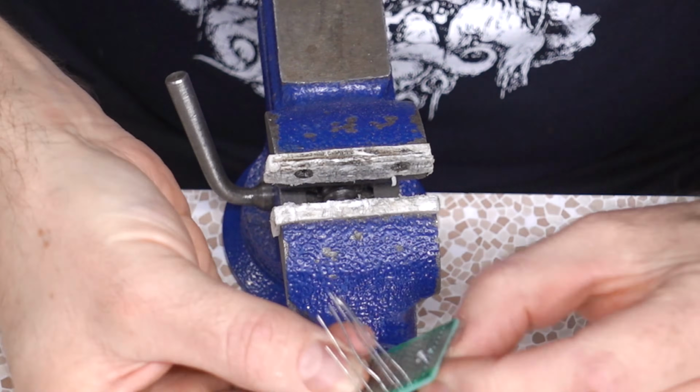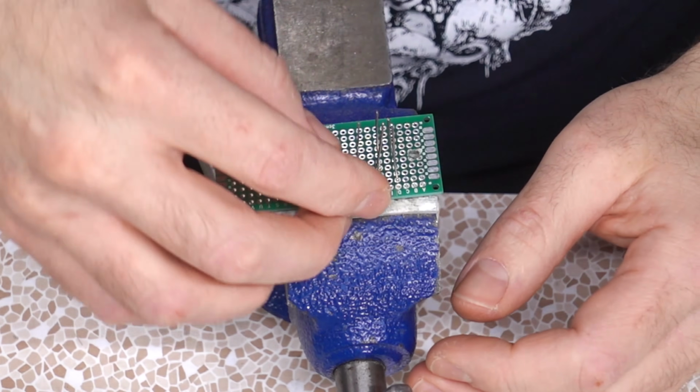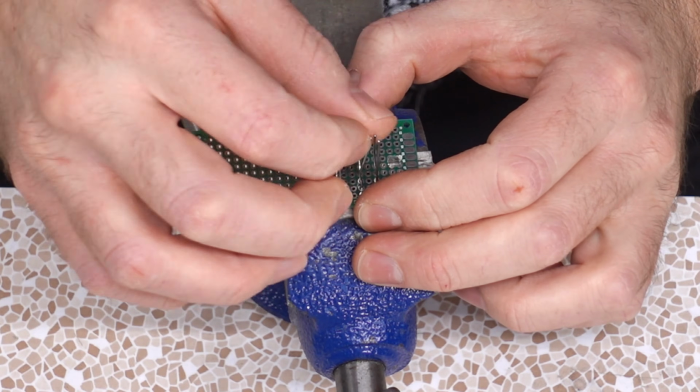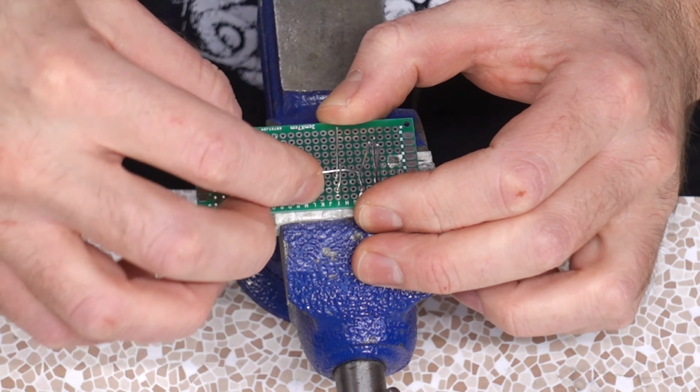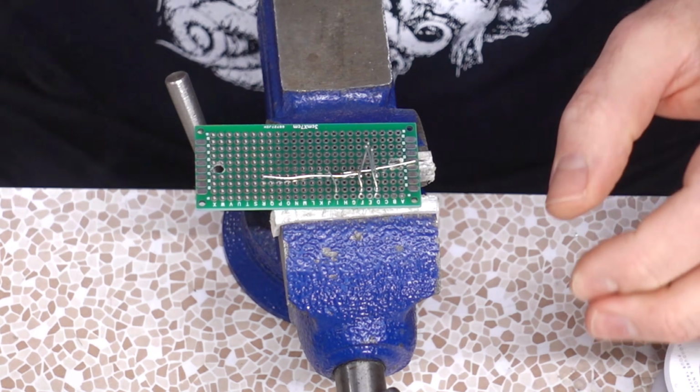Well, we got to get it started here. Start with the bridge, one capacitor. Holding these in place is tricky. Then I kind of have to remember what my positive and negative here is. Okay, positive's that guy. I have this simple process of just kind of bringing leads up to where they go and connecting them together. But let's not put too much solder on it yet.